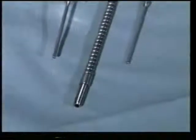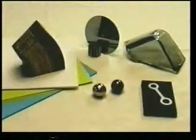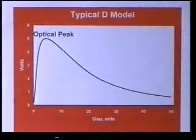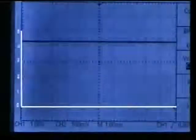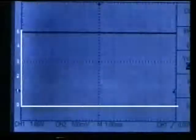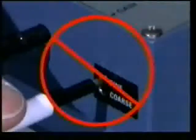Operation of the D model is identical to the RC model, with one exception: the sensor has to be calibrated to the target surface being measured. When you first position the sensor tip, you will need to find the point of maximum output voltage, also called the optical peak. To do this, bring the sensor very close to the target and adjust the gap until your voltmeter registers maximum voltage. Adjust the sensor gain controls so that the output voltage reads exactly 5.00 volts. You have now calibrated the sensor to the spot of your target immediately under the sensor tip. With RC models being reflectance compensated, this calibration step is not required.